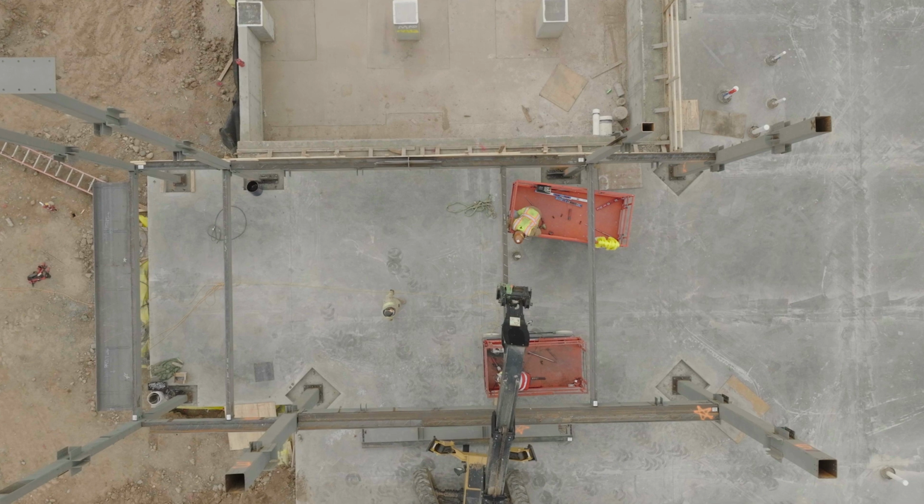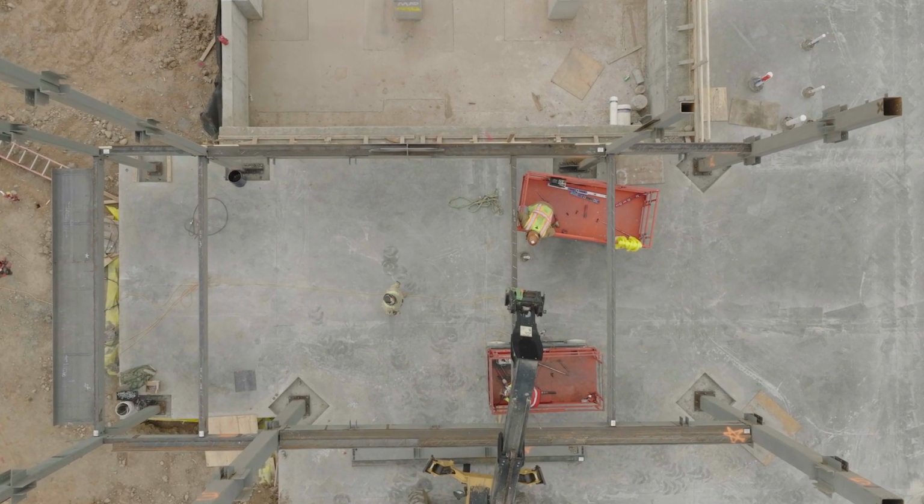Another development we're seeing in the industry that's really helpful from an HSS design standpoint is people are using more and more finite element analysis for connections. For wide flange connections, there's this huge volume of research and guidance that's been published, so that if you have a wide flange or similar type of rolled shape, and you've got some force coming into it from an odd direction, an odd location, there's probably some reference that you can look into that's going to give you design guidelines for how to make that connection. Because HSS has not been around as long as rolled shapes and has not been used quite as much, that volume of research is smaller.